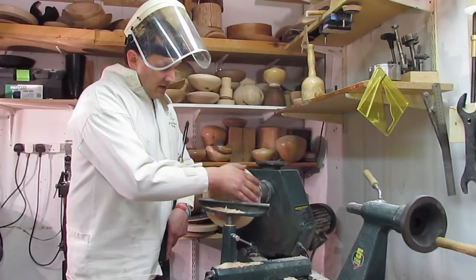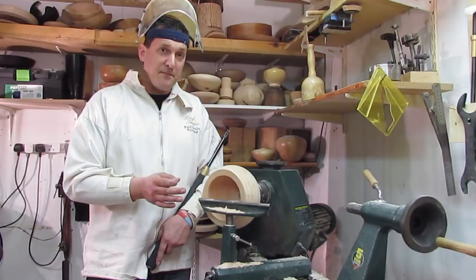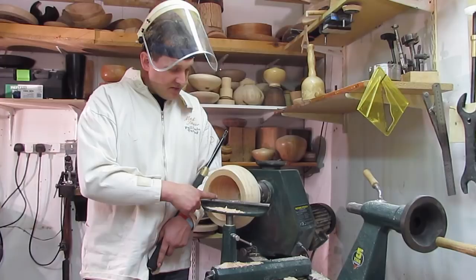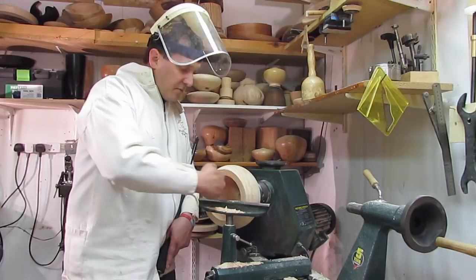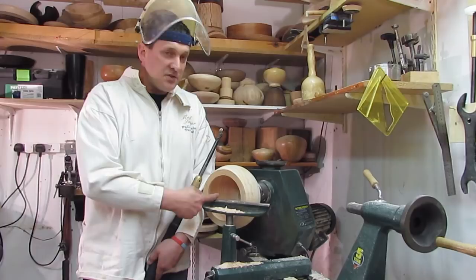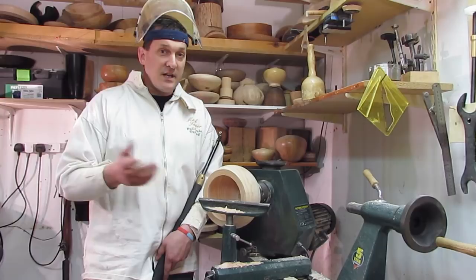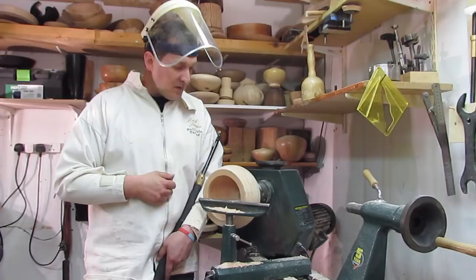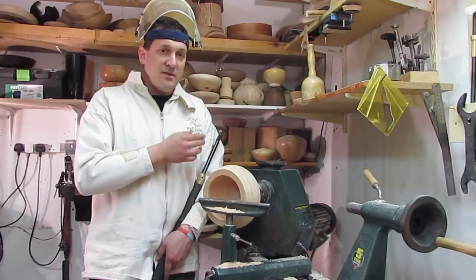I appreciate I've been turning for some time and people say it makes it look easy — and it is easy to use. Most tools are easy to use if you know how to set them up. Make sure it's set up right on the tool rest: handle slightly higher, cutting on centre height, rotate anticlockwise. The deeper you go, if the tool starts to chatter or you feel excess force, just rotate it a bit more anticlockwise and move your body around to keep the cutting edge perpendicular, so the forces go up the tool shaft and the tool rest rather than twist. If there are any specifics you're not sure about, email me and I can add something to this video to clarify. Next video, I'll show you how I'm using the finishing scraper with the extender on the inside of this form, and we'll look at using the super ring on seasoned wood. I hope you've enjoyed the video — see you next time.